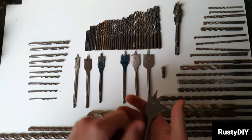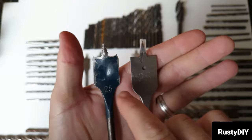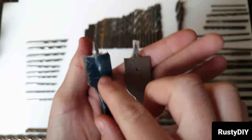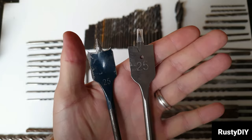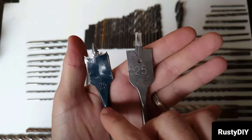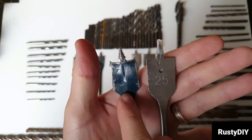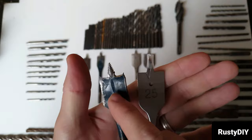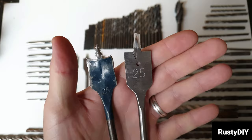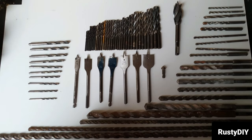Staying with wood, we'll move to flat wood bits. There are a few different varieties — here are two. One is a standard cheap flat wood bit, and the other, I think this is a Bosch one, has a corkscrew end and pulls itself in. You may also hear these referred to as spade bits. The corkscrew version needs a lot less pressure, so it's better in awkward positions, but it's slightly more expensive and more aggressive — if you hit a nail it can make the drill flip in your hand. I prefer the cheap standard flat bits; I've used them for years and drilled thousands of holes.